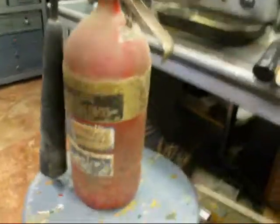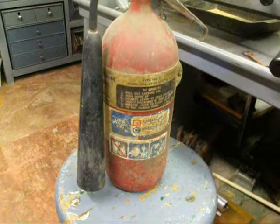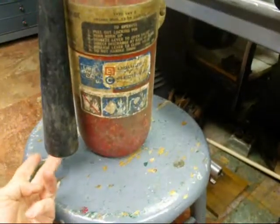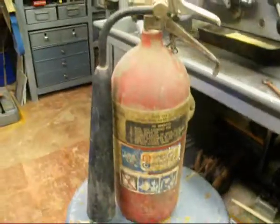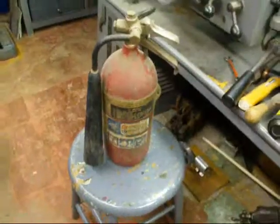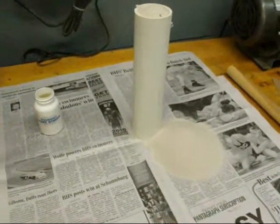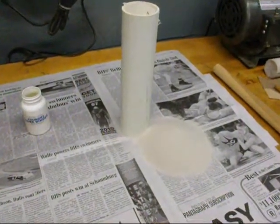My CO2 is nothing more than a fire extinguisher that I got at an auction. It works fairly well — I'll just put this over the pipe — however I don't have control over the pressure so I'm getting way too much and sometimes snow comes out, so that's not ideal. If you don't have an old fire extinguisher or any other kind of CO2, you can use your MIG welder. The shielding gas is only 25% CO2 but that will work.